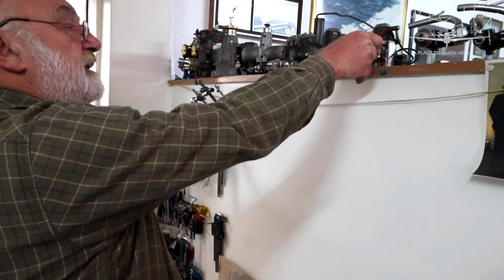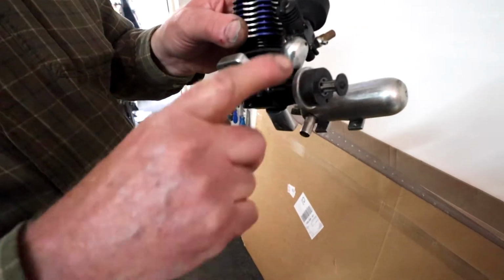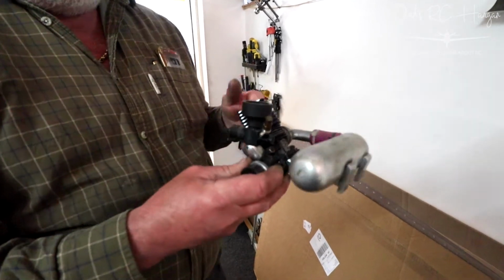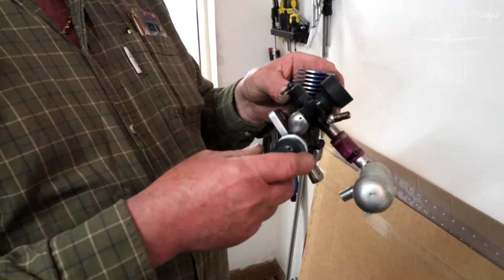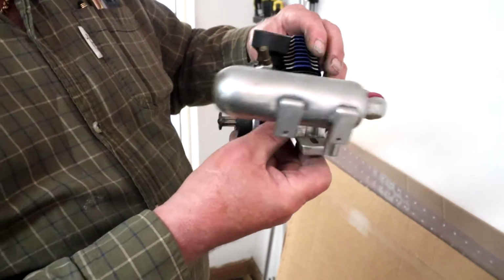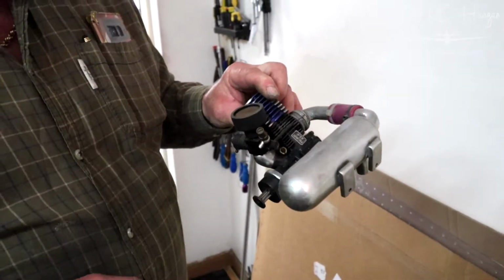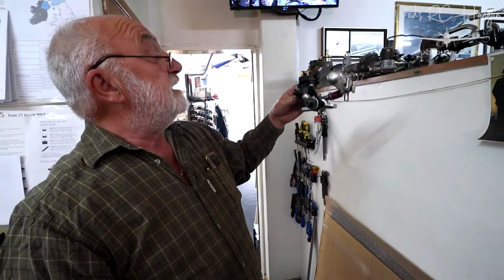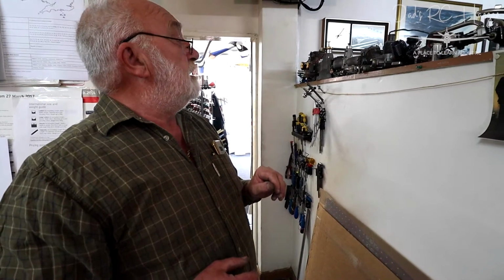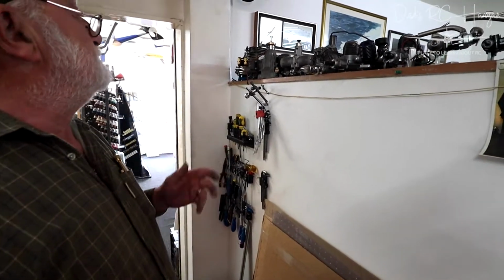That's phenomenal. This was another lot of work to build a motor for a stock car. This is the normal clutch setup, which I had nothing to do with. But this guy said he wanted a motor to rev to 15,000, produce its horsepower at 15,000, because most of the motors they were using were producing their power at 30,000. So I designed this motor. It's basically a Magnum XLS, but completely redesigned inside, with a longer induction track and a special exhaust. And it turned out that when he'd done his timing to say it was 15,000 RPM, he should have had 2 magnets on the flywheel, but he only had 1. So the motor was actually doing 30,000 RPM, not 15,000.